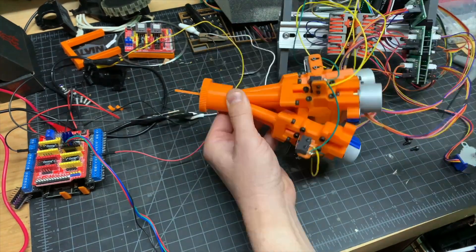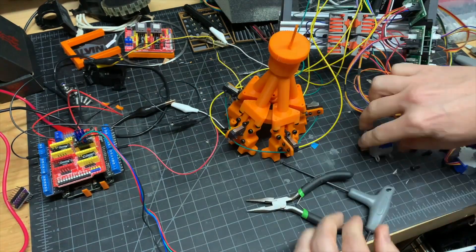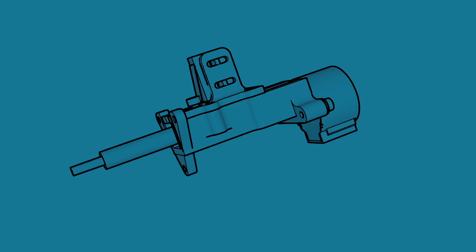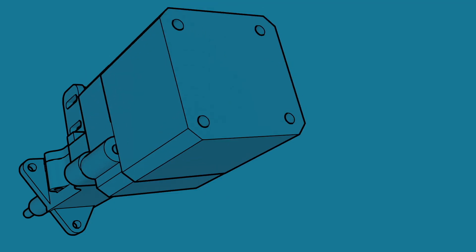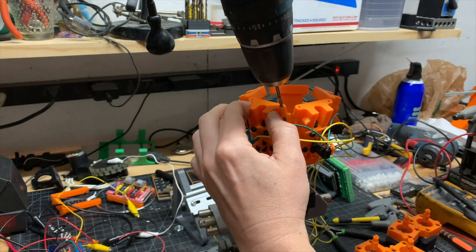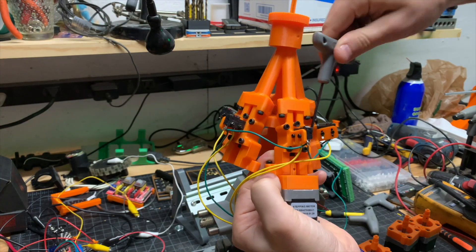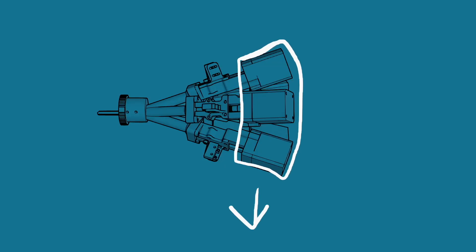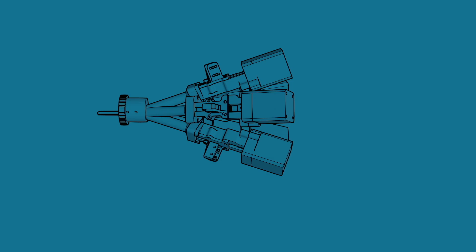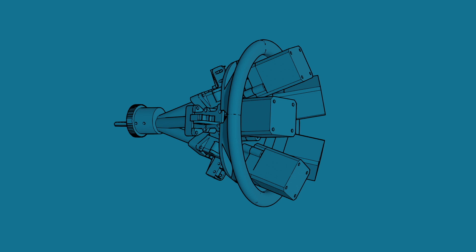Saving a dollar bit me this time, so we'll just order six NEMA motors and move on. Now we have the problem of mounting the NEMA stepper motors to the robot. Instead of redesigning and reprinting everything, I realized I could just make some adapter plates. With all the extra weight on the back side of the robot, we need to support it, so we'll add a ring that connects to all the arms for strength, put some v-wheels below it to allow rotation, and it'll be fully supported.